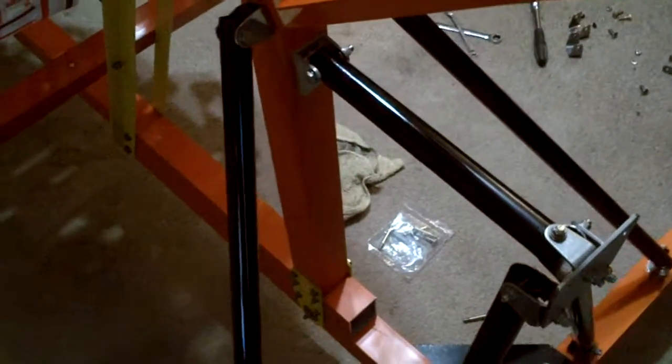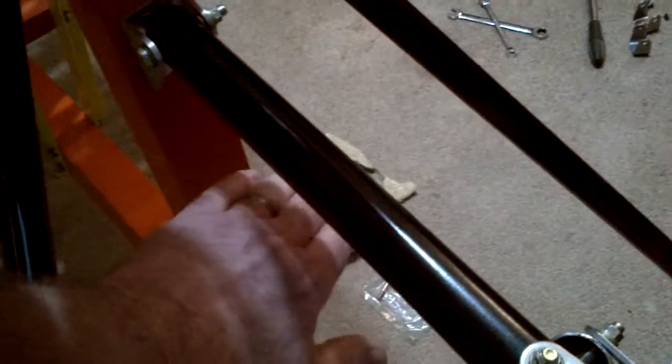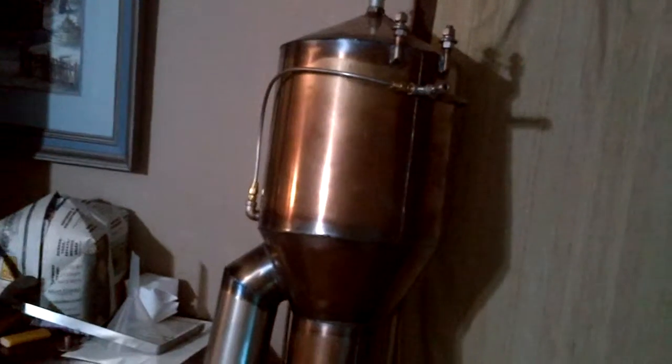So I'm going to pick me up a fire extinguisher bracket and probably mount it down here, mount a propane cylinder in it with the valve, the control solenoid, and then it'll just pop right through here and right into the bottom of the engine, as that goes to this connection right here. This is the starting fuel connection, and I'm going to try that initially, and if that works out, that's going to cut my cost by at least half to 2/3 on the rest of the high pressure liquid system.